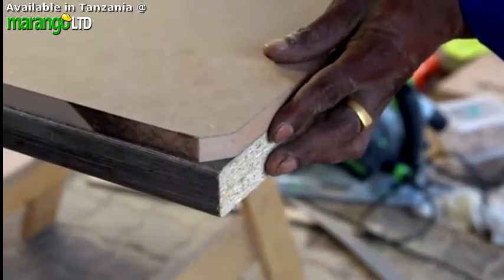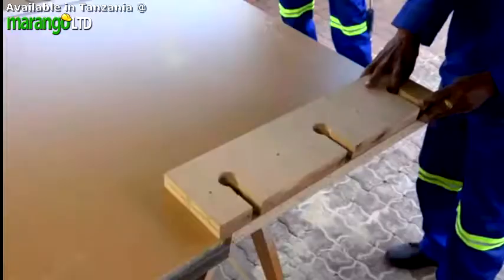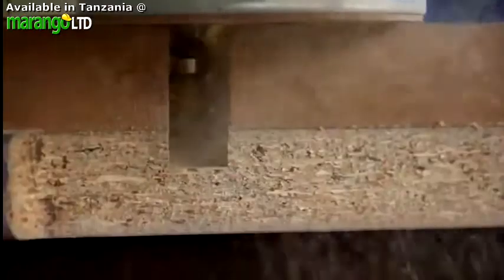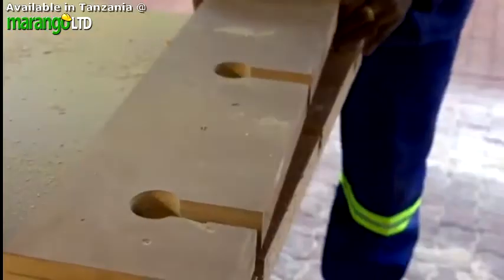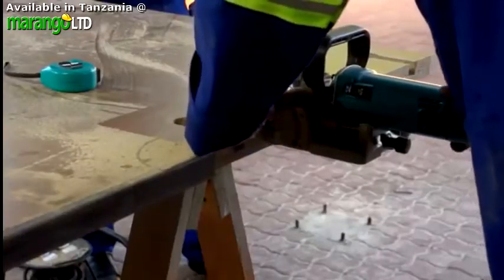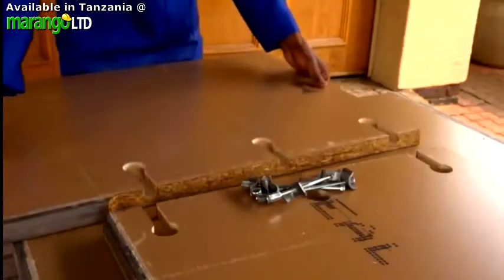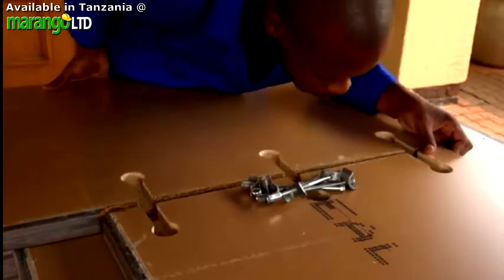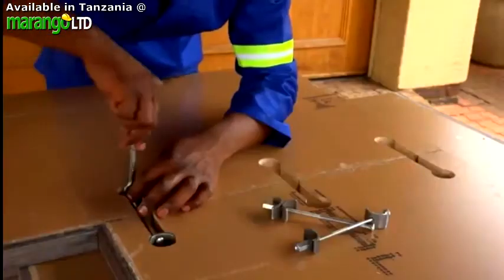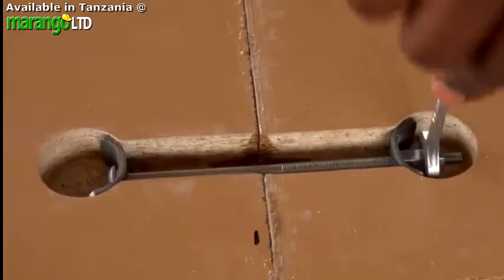To create the corresponding edge, use the appropriate guide to mark off and create the male edge. Turn the worktop over and position the jig in order to cut the slots for the undermount brackets, then cut out the slots using a router. Ensure you have cut the recess deep enough to house the brackets. If you have one, use a biscuit joint cutter and insert biscuits to align the two worktops and keep them in position. Position the male and female boards together, fit the undermount brackets in their slots and tighten. Now you have a perfectly fitted corner join for your Formica LifeSeal worktop.